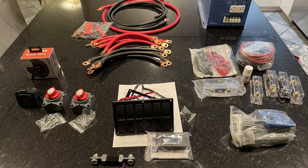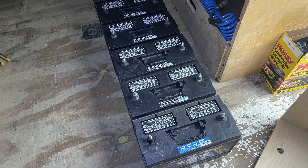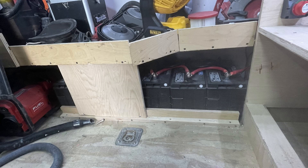I've got an Aims 3000-watt pure sine inverter with an MPPT charge controller with Bluetooth so I can monitor it, which is fantastic. I've got a 330-watt solar panel, fuses, and a battery cutoff switch. Then I've got six deep cycle 115 amp-hour batteries each, so that's 690 amp-hours total — but they're lead acid, so you have to cut that in half because you can't go below 50% depth of discharge.